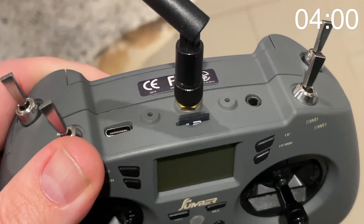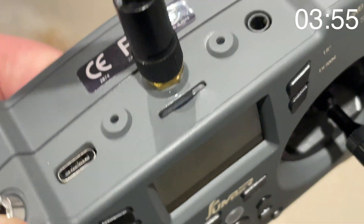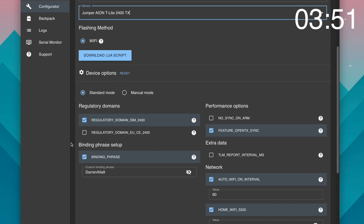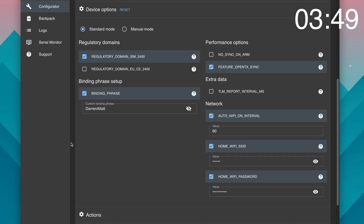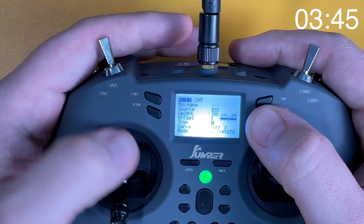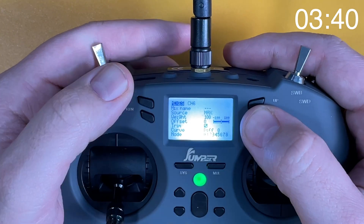Normally when you buy a radio you do need to buy batteries and an SD card and download the SD card contents off the internet. But it came with an SD card, so that saves beginners a lot of hassle. After plugging in the battery all I needed to do was flash my ExpressLRS configuration, turn off the ADC filter, turn off the external module bay, and then change the trainer setting to master. I also had to add my switches to the mixers tab so all my different outputs worked, and after that it was ready to go.